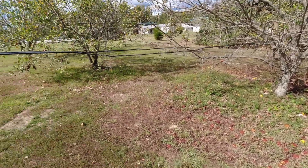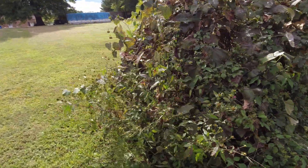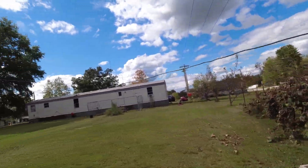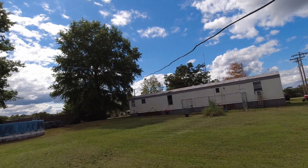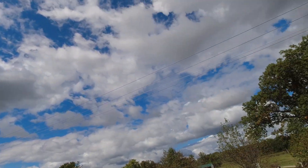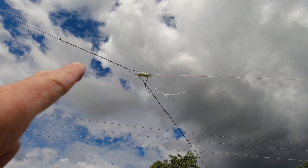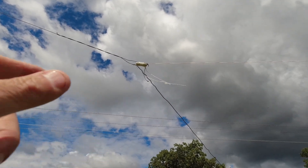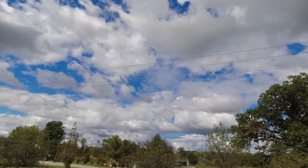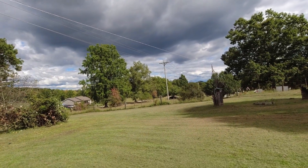There's a group of guys that get on early in the morning — I'll leave this connected like this, it's not in my way. I could leave it like this all winter and do some testing. What I think I'll do is hook the extra wire to the right side of the insulator and put a connector — an alligator clamp or something — so I can just clip them together to use it on 80 if I want to. I do plan on building an 80 meter loop in here. I've got plenty of room for that.